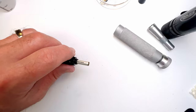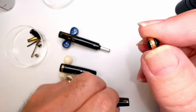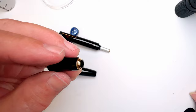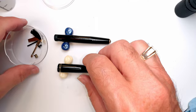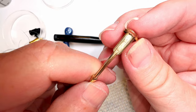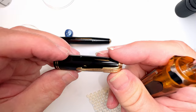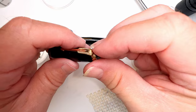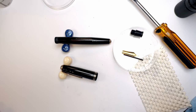Now I'm going to take the blind cap and put the end jewel back on. I polished that gold ring up with my jeweler's cloth — the little jewel just screws into the bottom. Using a little rubber matting to push it on and turn it tight. Now we can put the clip and the clip jewel on. Here's the clip — I've polished it all up, and polished up the brass nut as well. I put it in position so it's just between the two breather holes, then put the end jewel into the end of that nut, making sure it's nice and tight.